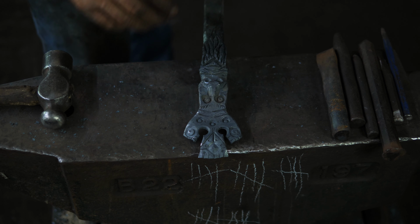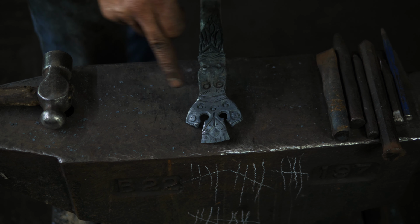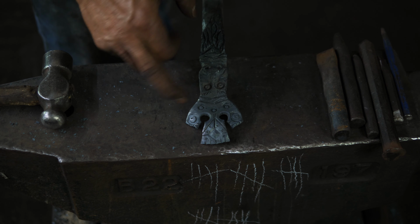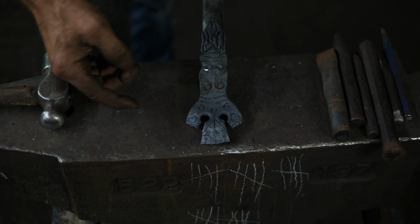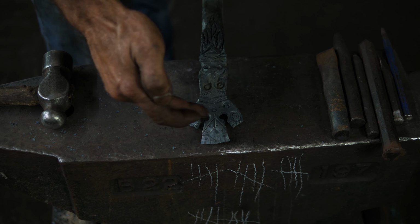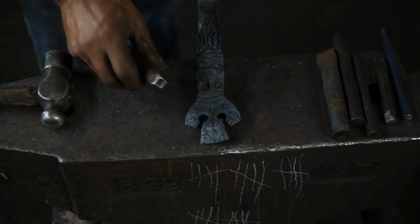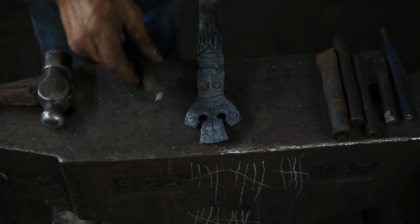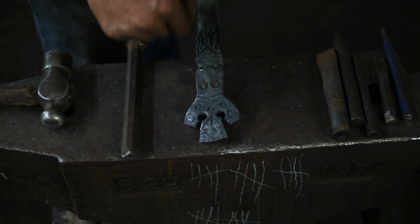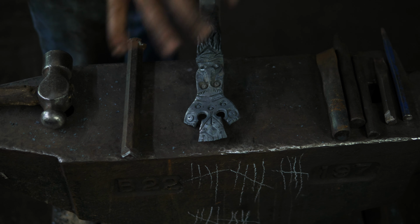All right, I'm gonna say that is good enough. You can just see that I just did a variety of different punches to do a decorative treatment to create that crown there. I really had no set agenda after I got my little keyhole cutouts, which if you've been watching my videos, you'll notice that's kind of my go-to when I want to do a decorative edge. Quickly, you can do something visually interesting that way. Of note, probably this punch with the little pyramid in there was the one that I used in the center there, and then other than that, bird's eye punches, center punches, and just chisels, just to create something visually interesting. So I'm just going to leave it at that.